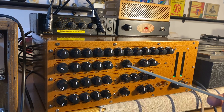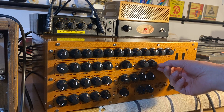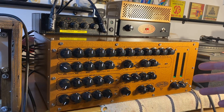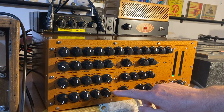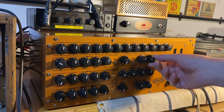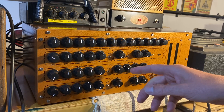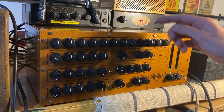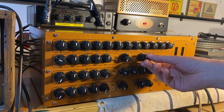So you can hear the echo there — when I switch this down it plays, and it stops when I switch it up. This is a particularly useful feature that I often use on my old Link preamp. You can just click in a little bit of the music and send it looping through your echo for great old dub-style effects. Each channel has got one of these. So that's how the echo works. This is the amount of echo you're sending from this channel, and that's the amount of echo from that channel, etc. You can also adjust it here on the echo loop so you're not sending too much signal — you can shape it so it's perfect and all on the same level.